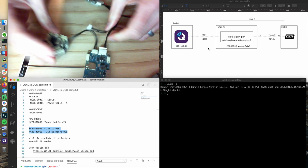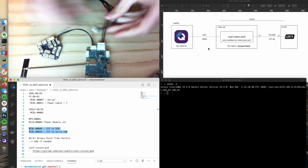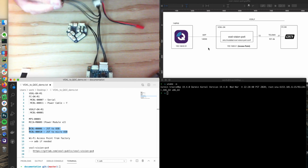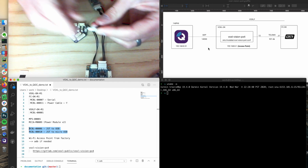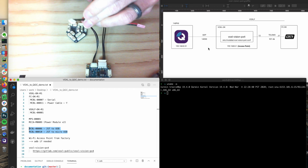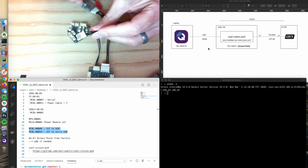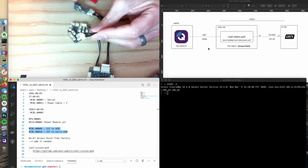Clips in. Okay, so then the other power cable is from the power module. It splits off, and it's a 6-pin JST connector with 4 wires going to it, and it's basically power and I2C line. So we get kind of our smart power monitoring. We can monitor the actual battery voltage and current, and the 5-volt regulated voltage coming out, and the current.